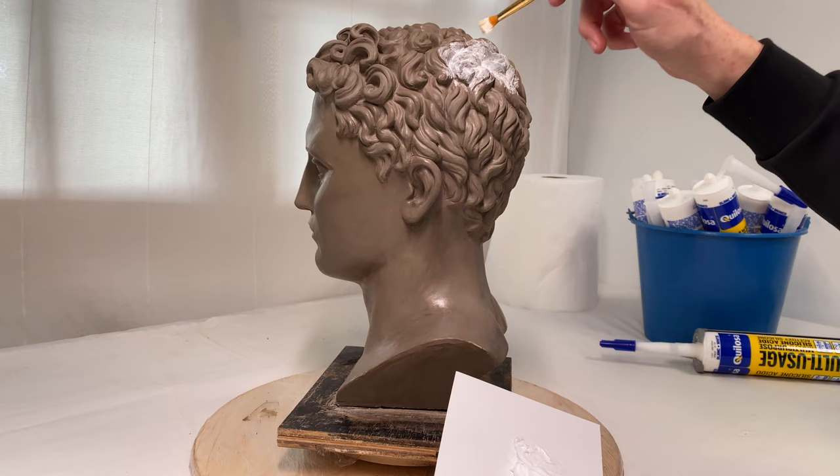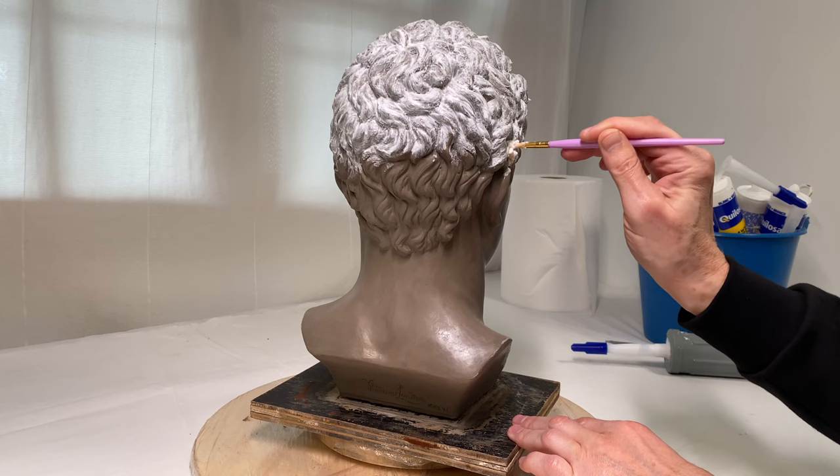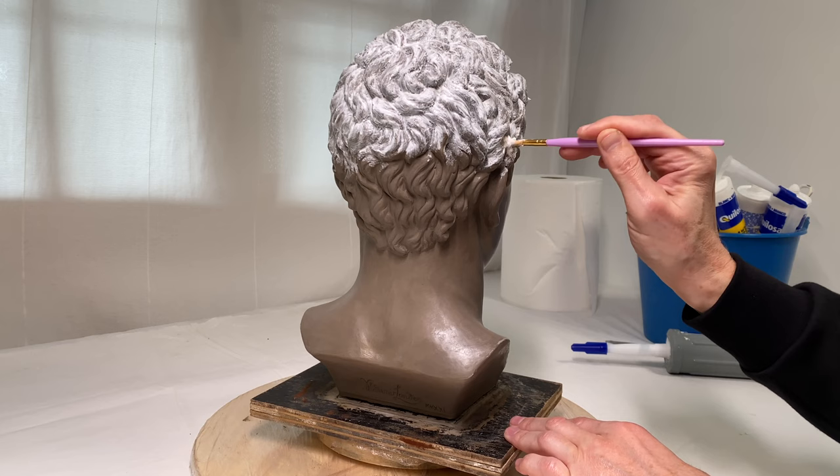Because this is the very first layer of the soft mold, it is very important to apply brush strokes carefully, covering all the areas. Every imperfection in this layer will be visible on the cast sculpture. Patience is required for this job.